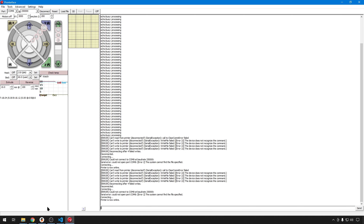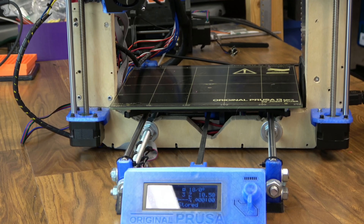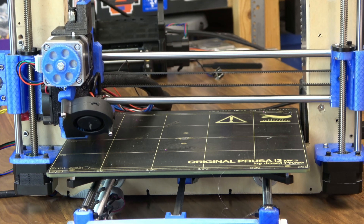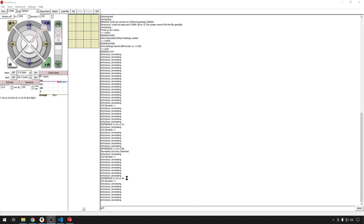With that configuration uploaded, in Pronterface we can run some commands. I always recommend resetting EEPROM when doing anything like this — run M502, then M500. Now when we run G34, it's going to probe multiple points and test how level that gantry is. It homes the printer, then starts taking test probes — one on the left, then one on the right — and makes lead screw adjustments on the fly to each motor. It outputs to the terminal so you can see what it's doing. You can see the different iterations; this does five. We were able to get from 3.89 on our second iteration down to 0.38, and it can get even more accurate than that.